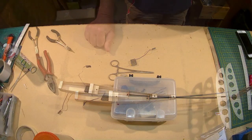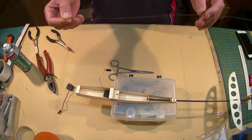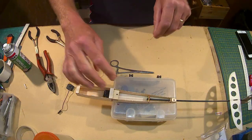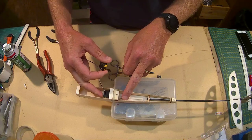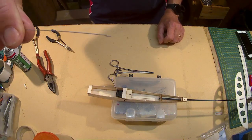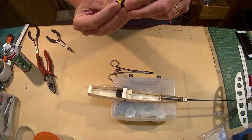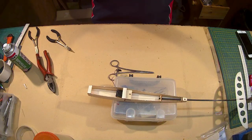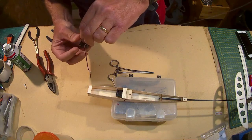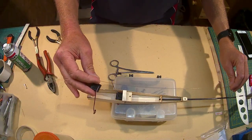I've got one servo installed. Don't cut the wire in half because they're actually different lengths and it might be difficult for your servo. What I've done is I've installed one, glued it straight in, and I've just done a little Z-bend on there. Then I'm going to feed this into the servo like so, making sure I've got the orientation right, and then I feed that whole wire down — at the moment I'm just leaving it loose.